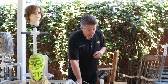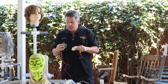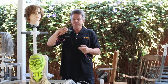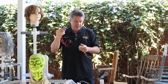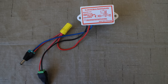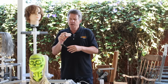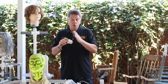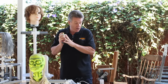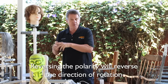One other option for slowing down wiper motors is pulse width modulation — PWM. There are lots of options; this one's from Fright Props, very robust and solid. There are also other models you can get online, and I'll put a link below. Be a little careful — some PWM units you get online will cause the motor to really hum when you slow it down, so you want to be able to control speed without getting that hum.